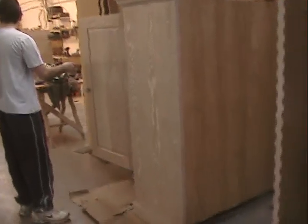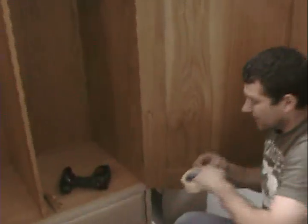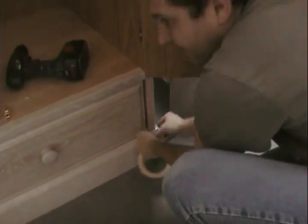This is the only one you'll have to put a bit of glue on, on the miters and there. They will have a block on there. And put just a dab of glue along there as well. And all it means you'll have to do is push it in place and get a bit of masking tape. If you're going to get me a bit of masking tape, Martin, please. Just to hold it so the glue goes off. So once there's glue on there, basically what you've got to do is just get this in position and tape it so the glue goes off, probably about a day. And the same on that side.